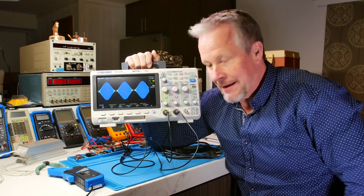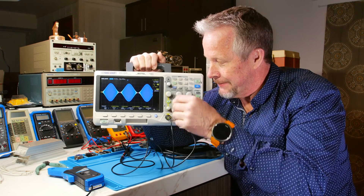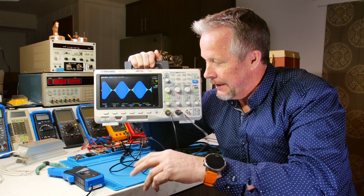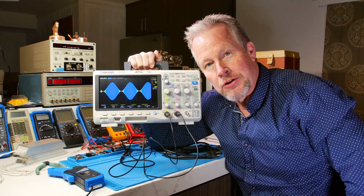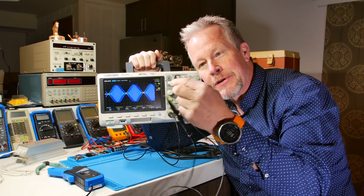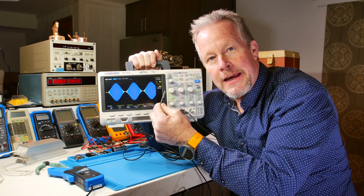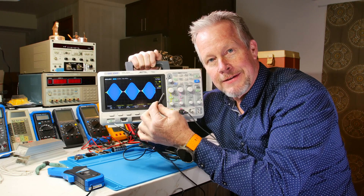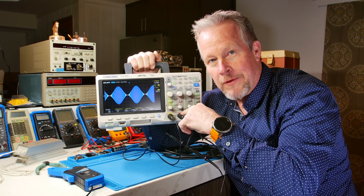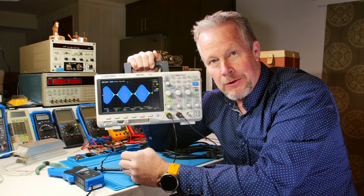The scope has all these little connectors, and you've got two channels on this scope. If you're connecting your scope up to your circuit and you don't put this little ground tip on the same part of your circuit referenced to the same spot, then your scope will reference them for you. You don't want that to happen. Your scope will short those for you.